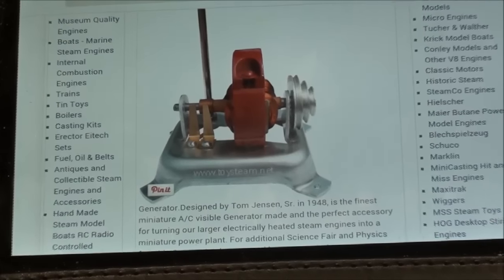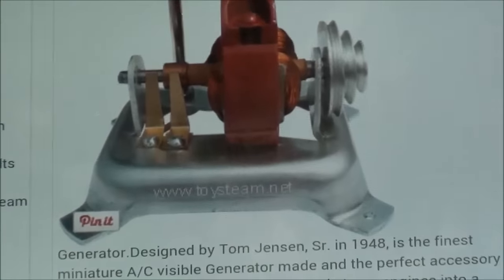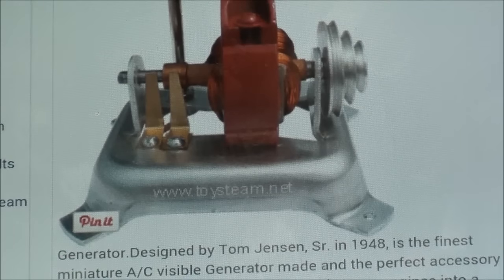And I haven't changed. But for $113 you can have that, and I think that's actually a bargain, because I've spent plenty of hours on this model. If you want one, there you go. I like the idea that they have a three-step pulley so you can get different ratios, different speeds. So, on with the build. I really wanted to use steel tubing, not brass or copper which is way too soft. I went down to O'Reilly's and bought this piece of 3-sixteenths brake line — that was six or seven dollars — and just threw the fittings away.